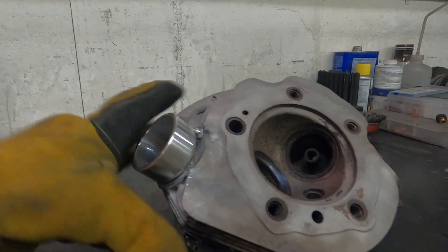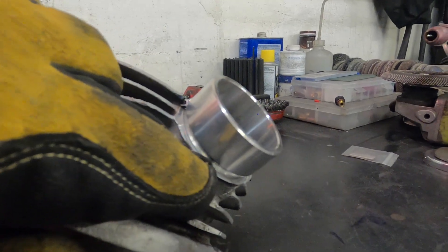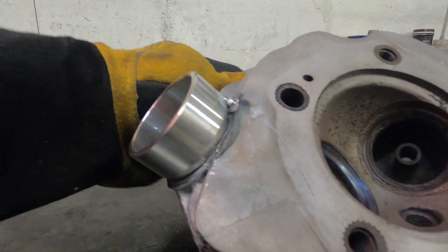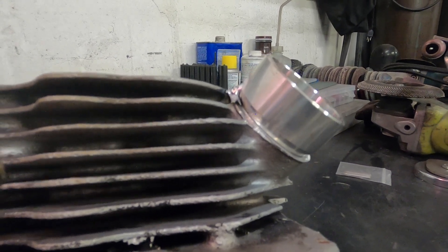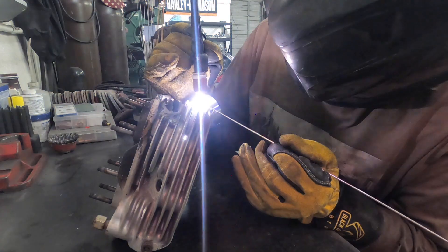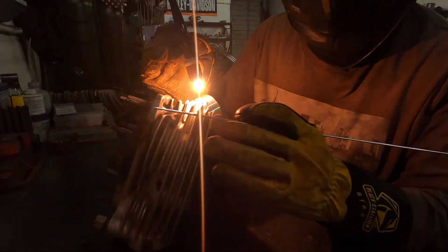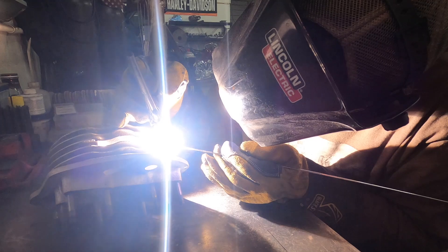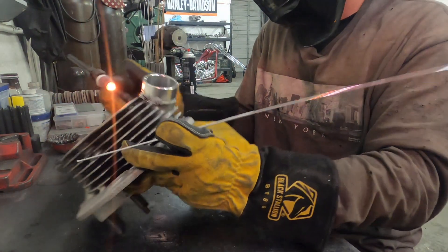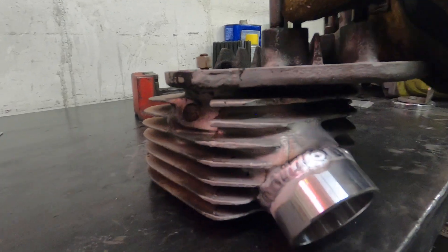I just put a little filler string thing, just folded in here to tack it. You can see these spigots are slightly larger than the stock, but everything is lined up on the outside as it should be — there's plenty of room. So now we can lay a good bead on there, maybe two more tacks, and we'll go from there. All right, so we're all welded up now — you can see we got a full seam all the way through the whole bevel. It actually welded decent for one of these old heads.